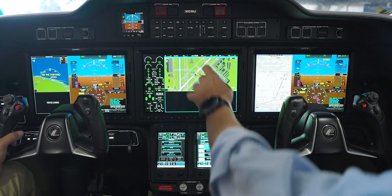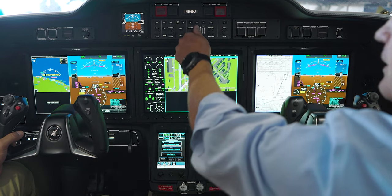As we're being vectored in heading mode, we always have a good visual of where the runway centerline is and which way we're turning inbound to the airport. Just like the G3000 and 750s as we fly the approach, gear comes down, lights come on automatically — it knows time of day. Pilot selects the flaps, pilot manages speed. On the Elite and Elite S and new Elite 2 — unlike earlier versions — it has coupled go-around. When you hit go-around mode at minimums, the autopilot stays engaged on newer models, making the highest workload scenario much easier.